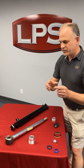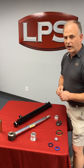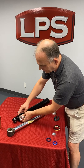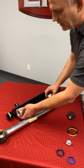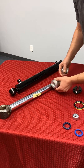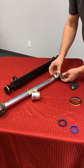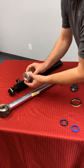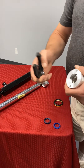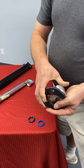If you do decide to replace your cylinder seals, the question is what's required, because maybe you don't have the equipment. This is the gland, also called the cylinder head; this is the piston — these aren't matched parts, I just dragged them off the shelf. This part slides over here, and this part fastens on with a nut. It begins by removing this part. There are a couple different designs. This is a common design and it's removed with a gland nut tool — some kind of tool with pins in it. You can buy different variations of it.